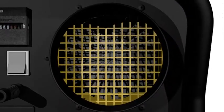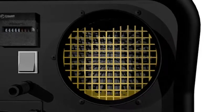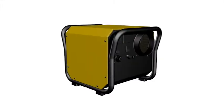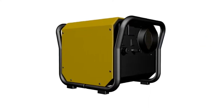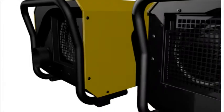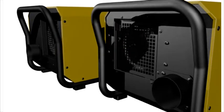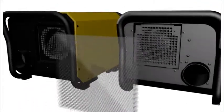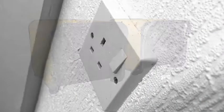EPD-200 has a second fan and a 3-inch 4th hole to take additional air, which can be used as the Regen air supply. EPD-200 can have all process air flow separate from Regen and exhaust air flow, meaning pressure-neutral drying is possible. Housing on the Regen air filter of the EPD-200 can be totally removed quickly if needed, or if easier to transport. Periodic dust filter maintenance is all that's needed for fully automatic drying, all day, every day.